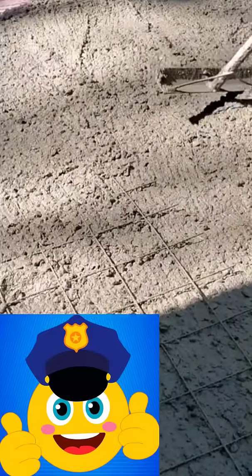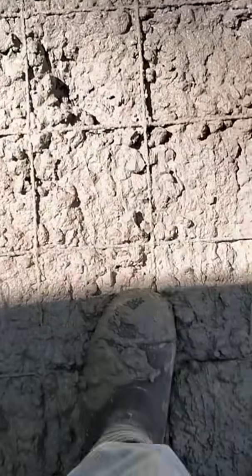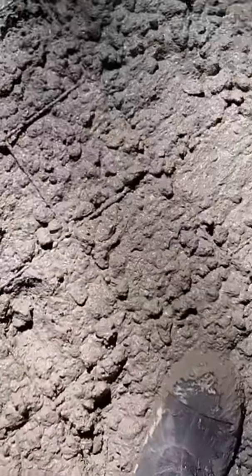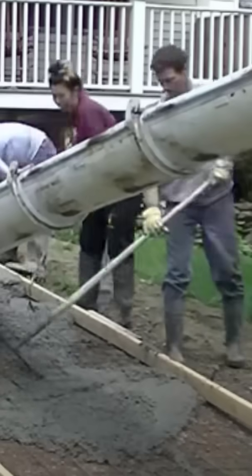This video is for the wire police and the slump police. The wire police think that when you walk on the wire mesh after you pull it up into the concrete, it goes right back down to the bottom. You can see here we've got pink styrofoam under the concrete, and the wire is coming nowhere near the pink styrofoam — and we've only dumped out two inches of concrete with another two inches still to pour.